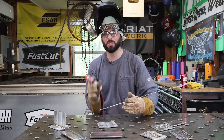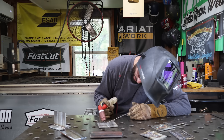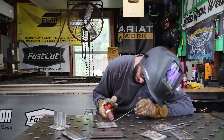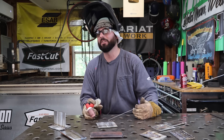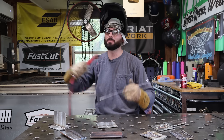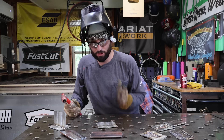If you can see that little deviation in arc length, you'll be able to weld a lot better. Get eye level with the weld when you're starting out and make sure your head is at the end of it. On a small weld, your head won't need to move much. But when it comes to pipe welding and making much longer welds, get in the habit of moving with your torch, always staying in front of it. Students slip off the pipe when learning to walk the cup because they're walking but their body hasn't moved with them. Keep that in mind — head placement is crucial.